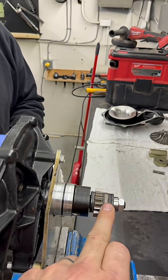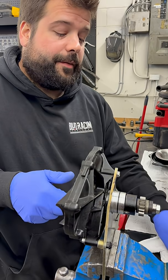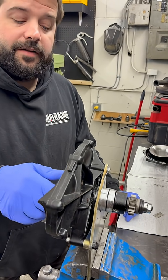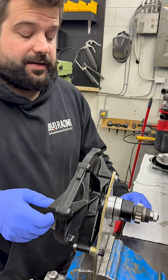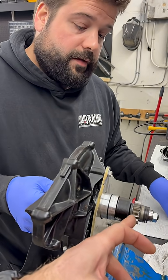What's the point of having a clutch on here? Because it runs right off of a ring gear in the engine bay, it needs something to slip when the RPM variance changes drastically. You don't want it to change RPM from 8,000 or whatever you're revving at to 1,000 instantly — it needs to slip to prevent the supercharger from blowing apart. So these little discs in here, that's what wears out, and that's what we're changing.